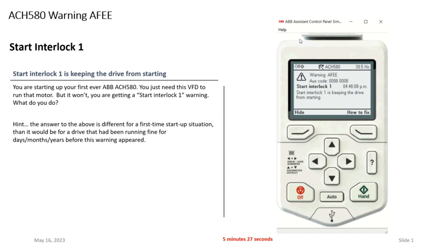You have a couple of options. One old-school approach is folks would just put a jumper on digital input 4 to make it go high. I don't like that approach — I'd rather just simply turn it off in the parameter. So I'm going to go ahead and hide that alarm. I'll come into here, menu, primary settings. I'm just going to use the HVAC quick setup and scroll down. It says 'use safety start interlock one.' If there's no safety wired to the drive, the drive doesn't need to be looking at digital input 4. All I need to do is go ahead and unselect that. You'll see that my flashing green light just disappeared because that alarm is no longer there. So if I needed to, I could go ahead and run my drive right now.